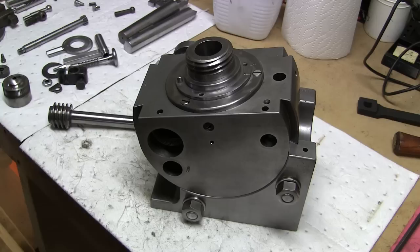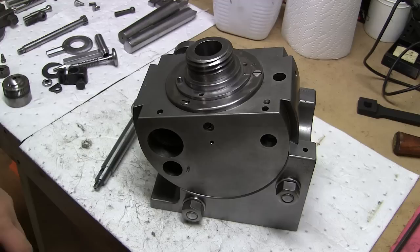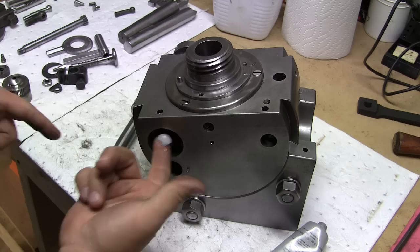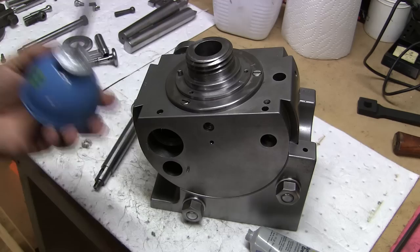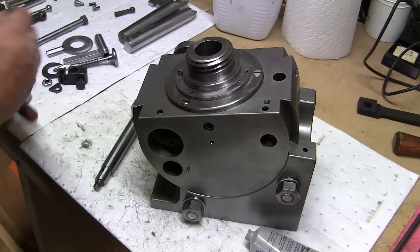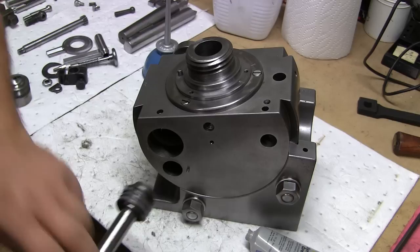The next piece that's going to go in is going to be the crank, which has a worm on it that will drive the spindle. So we're going to put a little bit of grease on here, and a little bit of grease on the threads in here. Bringing in some South Bend oil, the C type, just for some of these shaft parts, just to give it a little slick of oil.